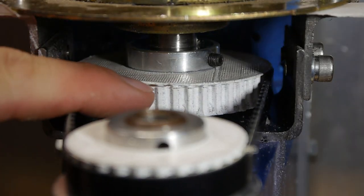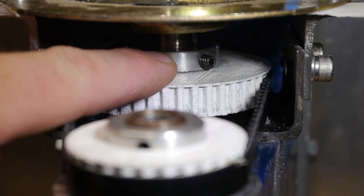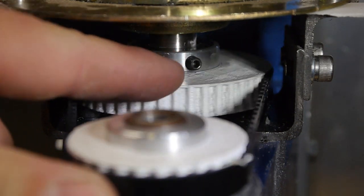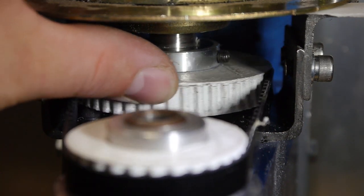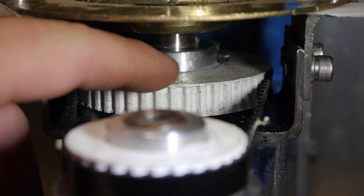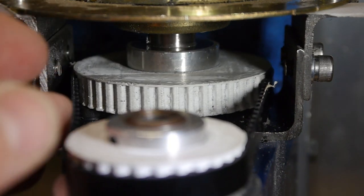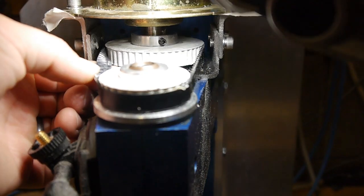Well, that just sucks. Starting to get some delamination here, and in general, it's not all that stiff. For my ABS, very cheap 3D printer, synchronous timing belt pulleys are probably not viable for very long. I think we're going to go ahead and try machining down some aluminum and going with that flat orange polyurethane belt that I had a while back, and just see how that performs.